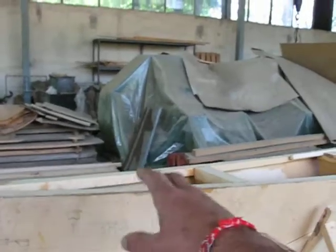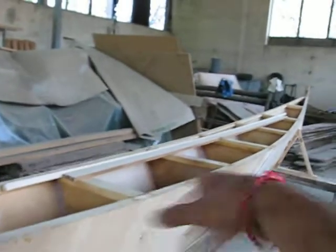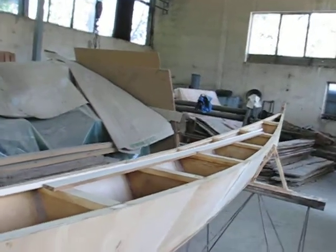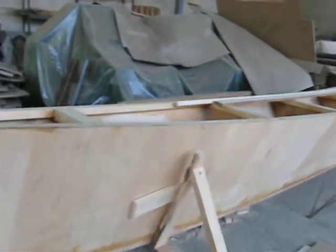The lee pod will be strengthened with a lot of material, a lot of fiberglass. Might have a shroud going from here up to there, and then the whole business gets connected to that — we'll try to make it tough. Over here we have the ama: two watertight compartments, then all this is water ballast, and then the two other compartments at that end are watertight again. Stitch and glue, 4mm ply, poplar.